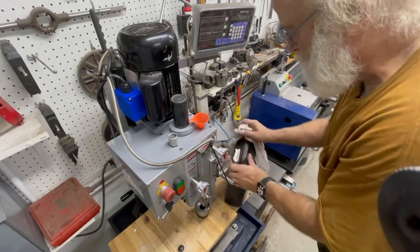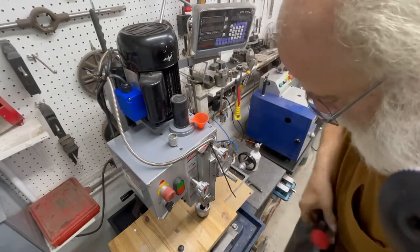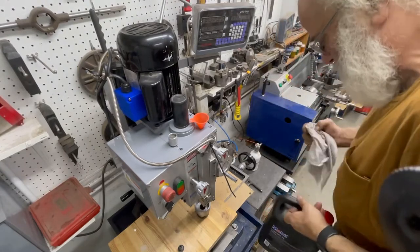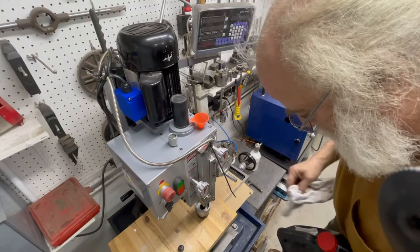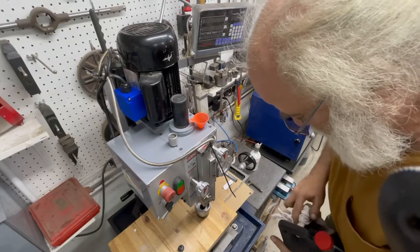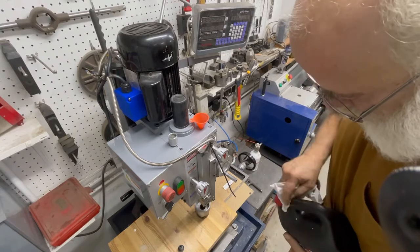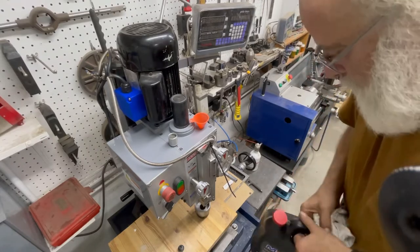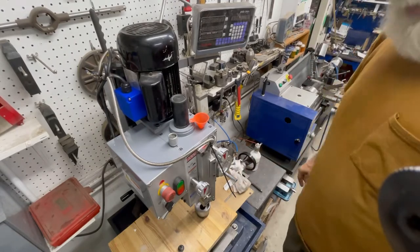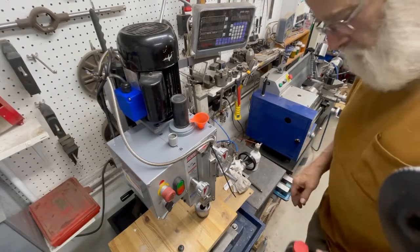Let me get the dirt off this bottle. You always want to make sure you're not putting dirt into a machine when you're servicing it, which is, in a lot of cases, the true cause of failures. If anybody out there that does work on their cars wonders why some of the newer vehicles do not have a dipstick for the automatic transmission, it's because they figured out people were getting dirt in there, checking them all the time.